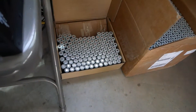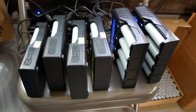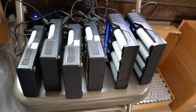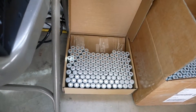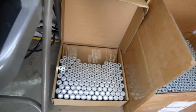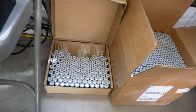A large majority do not pass the first time and need to be tested at least twice. The first test kind of wakes up the cell and then they might test good after that. I've got five chargers here testing cells 24 hours a day, seven days a week over the last two months, and I've only gone through that many cells. With the other 800 cells from a year ago, I would have been probably 60–70% done by now with all 800 of them, because they all tested 4700 milliamp hours or better.